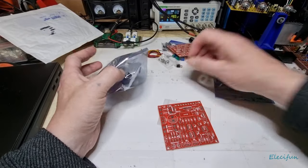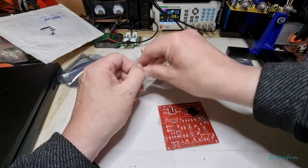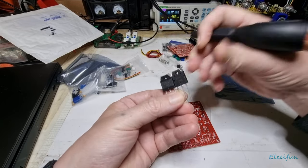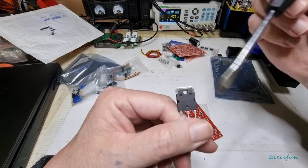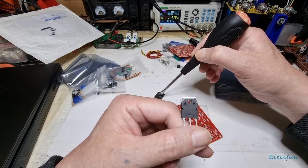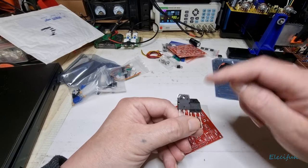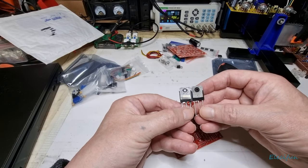What I was saying about the pass transistor — let me take a peek at that one. And then you look at this one; without even taking it out I know what it's going to look like — it's going to be a dodgy one. Here's the difference — do you see the difference? It's almost like it's been cut into this one, but it's just different. This is how the original ones look. I'm not saying one of these won't work — I actually tried one on a genuine working board and it worked. I'm not saying it will be as robust, but all those ones I've had have been fine. There's a little bit more to these as well; they've had these dimpled parts cut into them, so it looks like there's been more work done. But apart from that they look pretty similar.